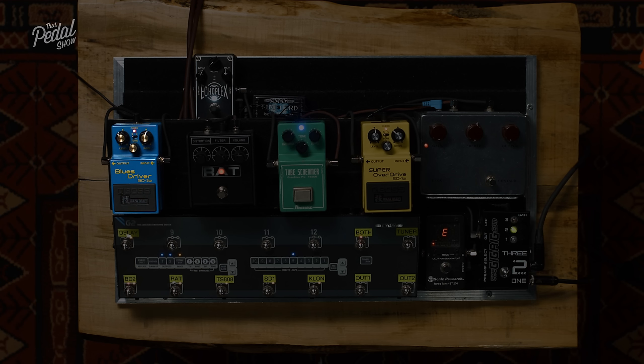we clip that signal. Amplify and then clip, amplifies, presumably. Yeah, amplify and clip, and also some tonal shaping going on there. Then we have our tone stack, the EQ section, which again gives us further shaping of that signal. Then the output stage, getting the signal ready to leave and enter into the world. Yep. And that's a really basic understanding of what's going on, but